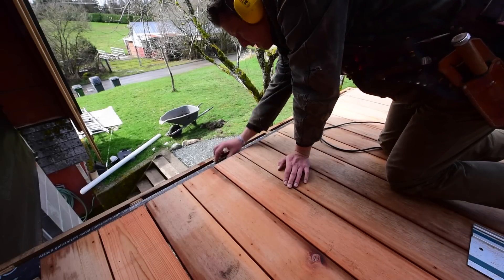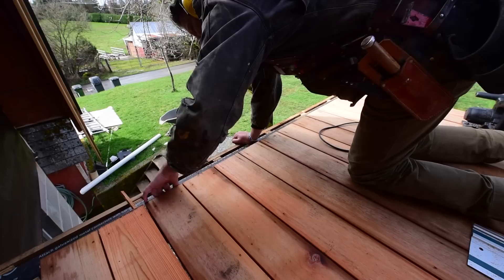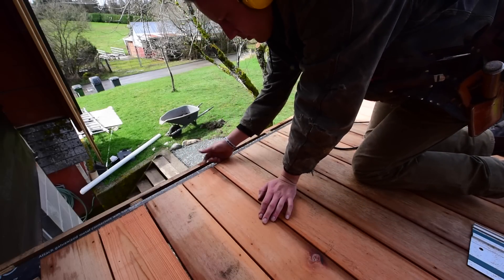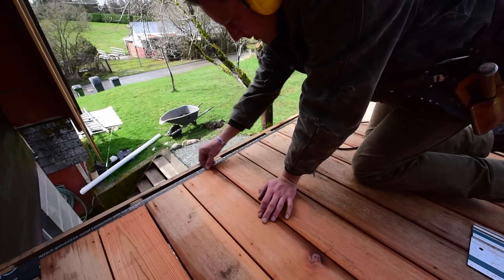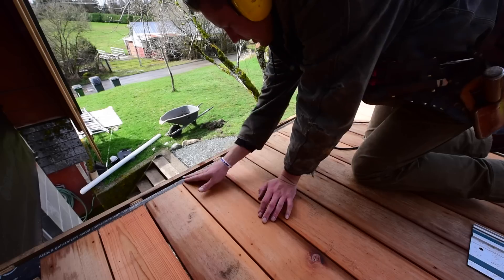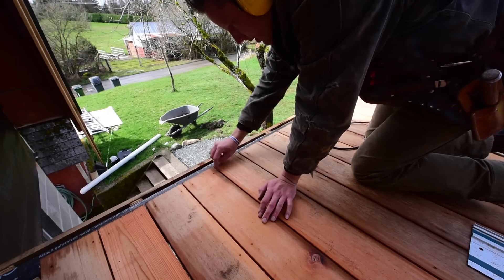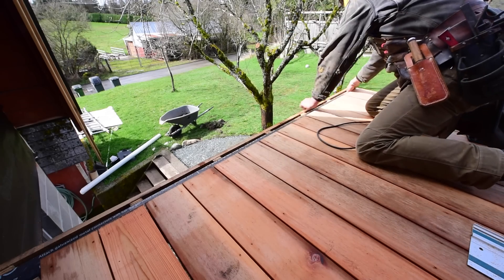The cuts are all square. Before I install my trim board I'm gonna take my laminate trim router and put a one-eighth roundover on it — just hit these ends so I don't have that sharp edge. It'll have a nice little one-eighth radius like the sides do, which makes it look that much more professional.